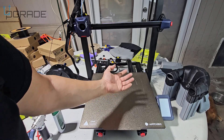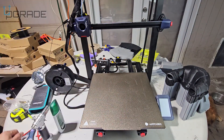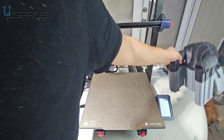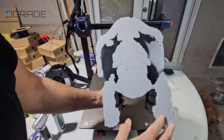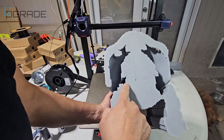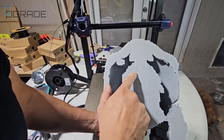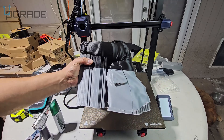One thing I didn't like is that it had extra filament that needed to be cleaned up — it doesn't purge or clean itself at all, it just keeps growing. I had to intercept some of the filament on the first layer because a messy first layer can ruin the whole print. Luckily I learned from a smaller print first and applied that to this large one. If you notice the bottom, it's perfectly fine. At first I thought it was going to mess up, but it recovered really well. The Z-axis isn't 100% correct but you can manually adjust it while it's printing.